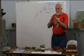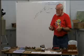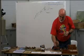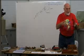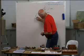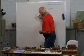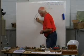and what that does, it opens out the face of the tool, so that when we're engraving on copper or silver or brass or whatever we're using, or wood even, and I prefer to use the tool with the shoulder ground into it, even when I'm doing wood engraving like this one, it opens up the face of the tool so we can see much more easily where we're going. This part underneath here is called the heel or the belly, depending whether you're an American or an Englishman. And of course, this is your cutting face.